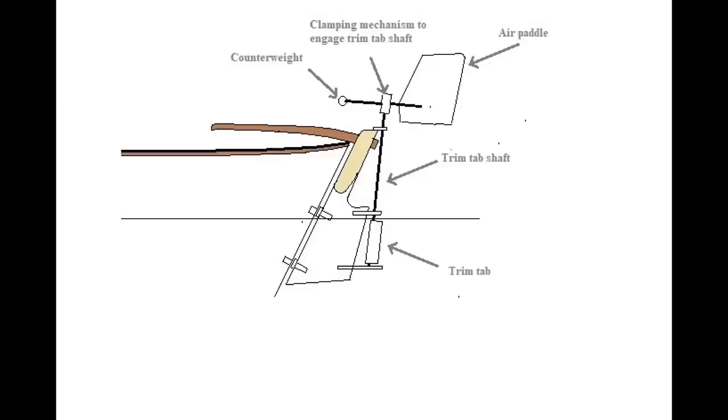For those of you who are unfamiliar with the Hasler-type self-steering wind vane, perhaps a quick review would be helpful. The first caveat with this type of self-steering wind vane is that it can only be implemented on a stern-hung rudder. But given that, it is the simplest type of self-steering wind vane devised so far, and only a semi-skilled job to construct out of off-the-shelf materials, so it lends itself nicely to the amateur builder.